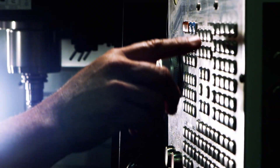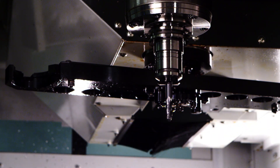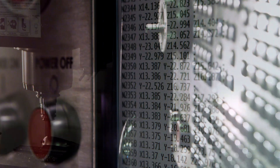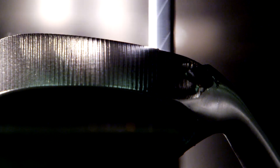The milled grind operation that we use with the technology we have now — it's perfect every single time. The milled grind process uses a really large CNC machine that's numerically controlled to replicate our CAD models perfectly. It's going back and forth, machining exact to the geometry that we want. For us to mill our grinds and have that be consistent and correct every single time means the consumer is gonna get what they think they're buying — what they need.